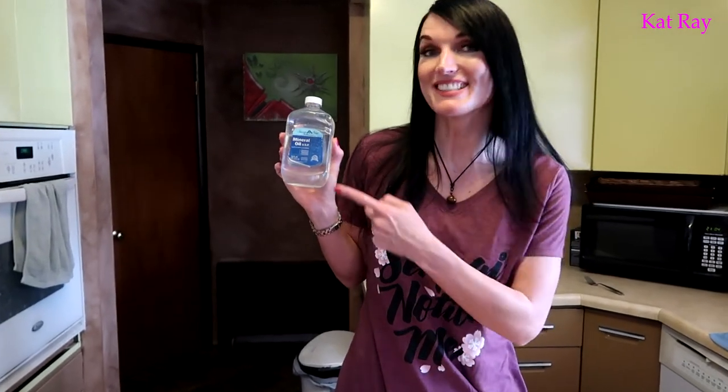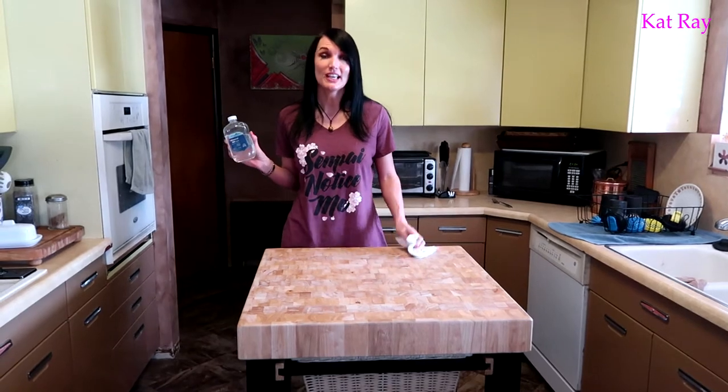The most important thing to do when you are conditioning your butcher block is to pick a food safe oil. We picked mineral oil — it's kind of an old bottle, but mineral oil is very, very food safe because you don't want to use something that's going to make people sick. We take the food safe oil, take this soft rag, and we'll just put a layer on it and see how it does. We'll come back in about a half an hour to an hour and check it.